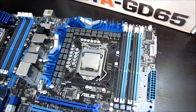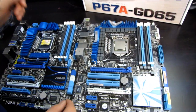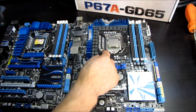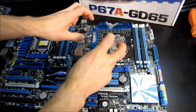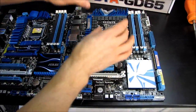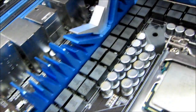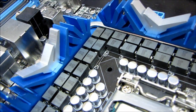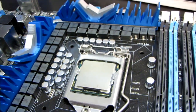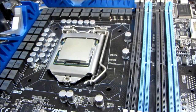On the right hand side here you're going to see an LGA 1156 motherboard. This is the old P7P55DE Premium. This is a Lynnfield socket — it's a Core i3, Core i5, Core i7, whatever you want to call it. This is an LGA 1156 motherboard with LGA 1156 mounting holes and an LGA 1156 keep-out zone. The keep-out zone is what Intel specifies as the minimum amount of space around the socket where there can't be anything.